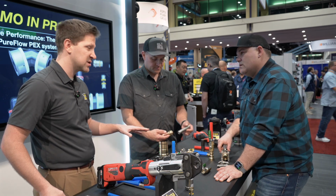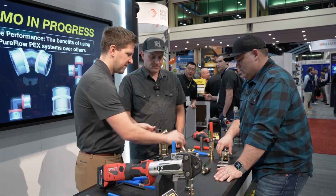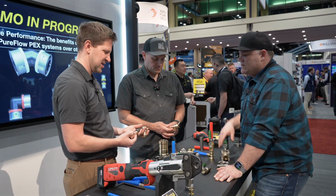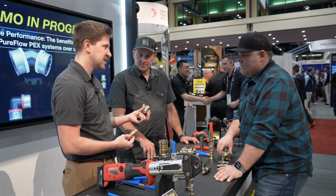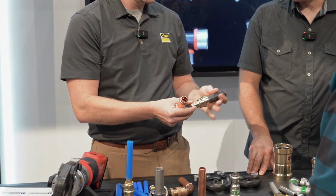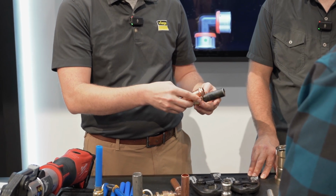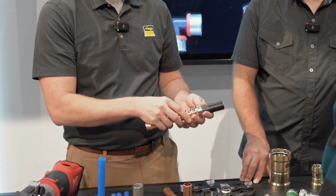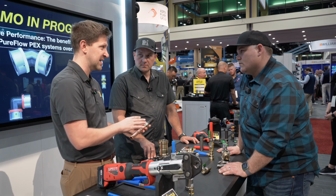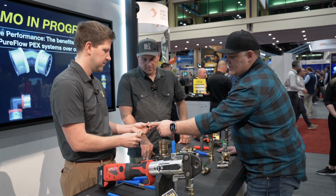Well, we've got some technical explanation here, but we don't have to get into it too much. Everybody knows you're not going from copper directly, that's going to be cathode, anode. That's going to cause a lot of issues. But if you take the bronze fitting, which we've never done in the MegaPress side, nobody's had a pipe connection on the bronze side. You connect this here. This is galvanically similar, much more so than this, and the same here. So basically, instead of creating one large battery, you're creating two very small ones that may have an insignificant effect on the overall system.